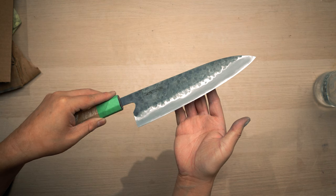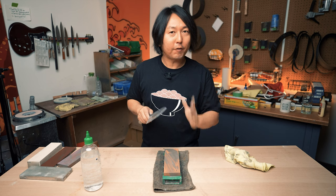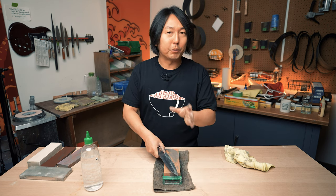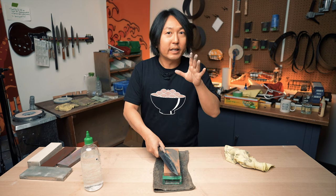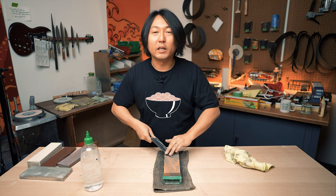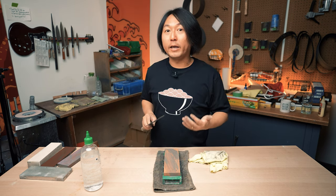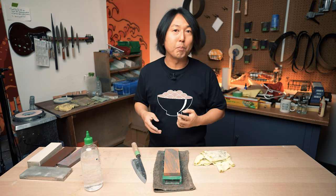That was the end of shaping the bevels. Don't forget to sharpen after this though. Sharpening means putting the last edge on, 15 degrees or 20 degrees, whatever you want, because leaving it as the clamshell grind is pretty fragile. Always put the last 15 degree edge on them. So that was how to make a hamaguri grind or maintain a hamaguri grind. Don't forget to put the last edge on, because that is a very essential part of sharpening.